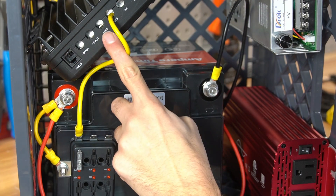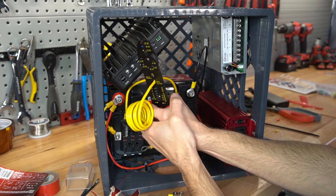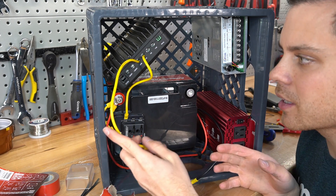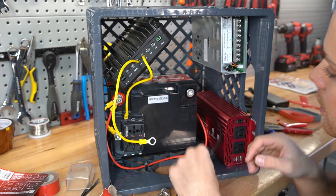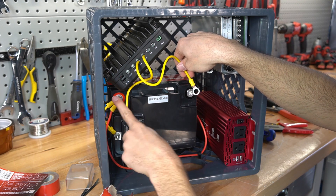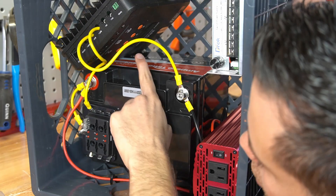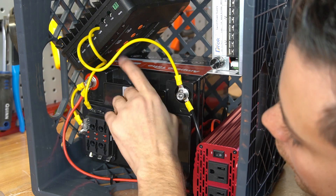Now we need a wire from the battery negative over to the negative terminal. Measure and cut the wire and loosen the terminal. Your wires do not need to be color coded for polarity — considering the price constraints, we're sticking with the cheapest single-color wire. Make sure you do not switch these: battery positive needs to go to battery positive and battery negative to battery negative. Check your connections before connecting to the battery. Now the solar charge controller is on — connect some solar panels to the two input terminals and we will have power.